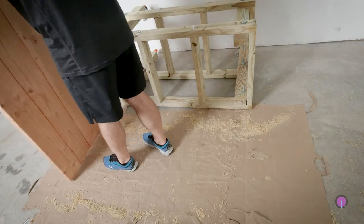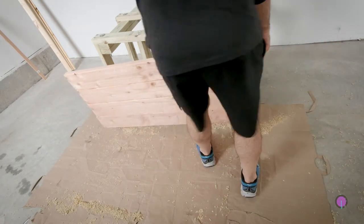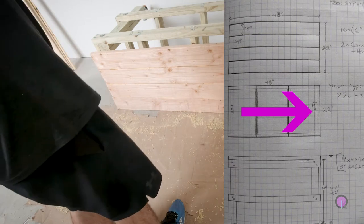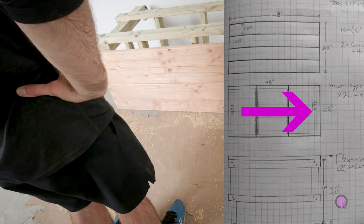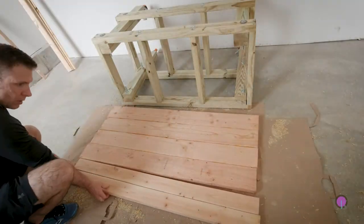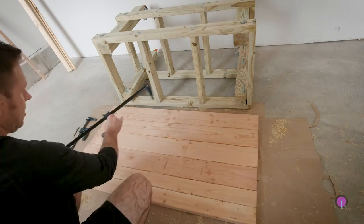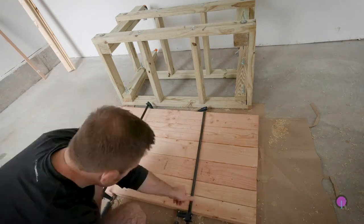Now all that remains is to fasten the top to the frame. I thought I'd do this upside down — drag the top out, turn it upside down and screw everything down. But it turns out I'm an idiot and I went ahead and made the wrong size top. The problem was that I said I needed to cut the support beams to be 22 inches long — that was incorrect. I needed them to be 22 inches as the total frame width, not 22 inches per piece. So I had to run back to the lumber yard, pick up another two-by-four, have it cut down in half the exact same way, bring it back, glue everything together, reclamp it and let it dry once again before I could screw the top to the frame.